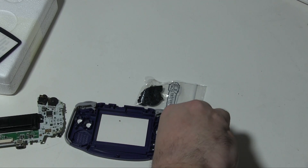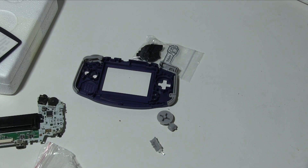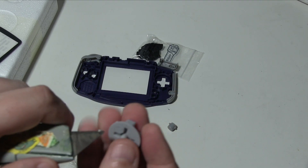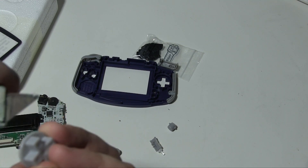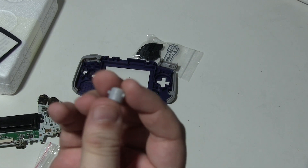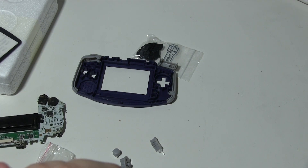Let's get the buttons out. One of the problems with these buttons is that because they're molded, they're going to have little sprue points on them. So we're going to have to smooth those bits down with a knife. Otherwise they're not going to move as well as they should. We just want to make them as flat as possible. This is especially important on the buttons because they will get stuck inside the case if they are not flat.